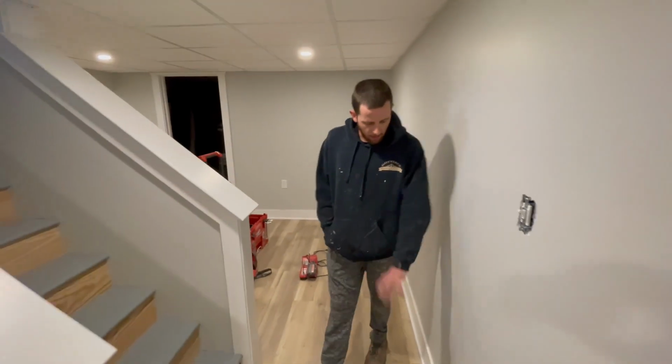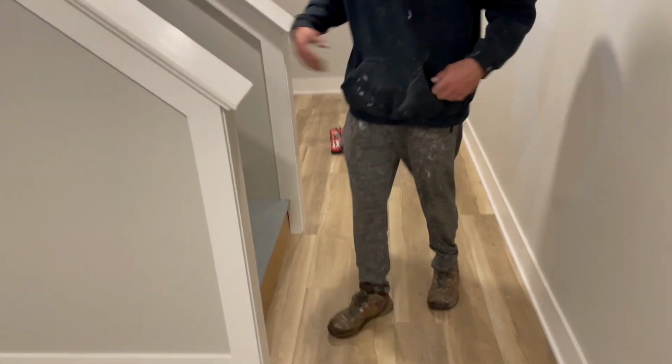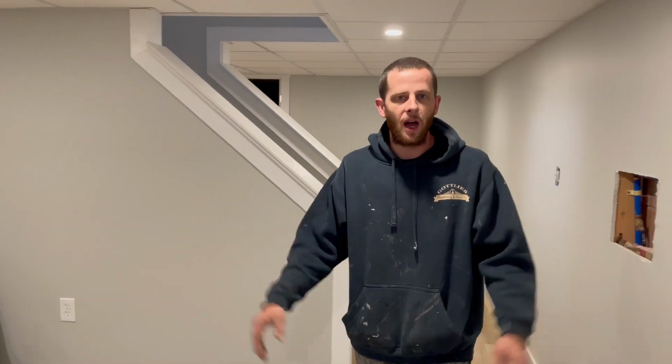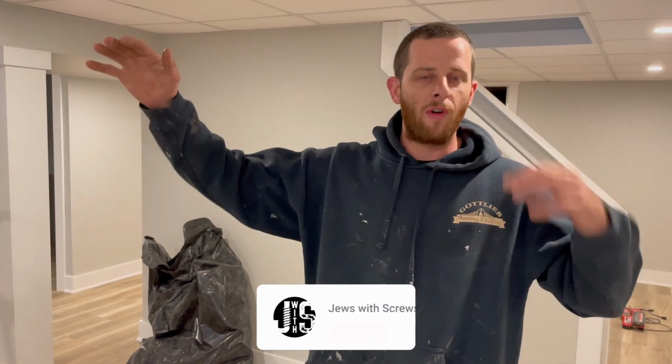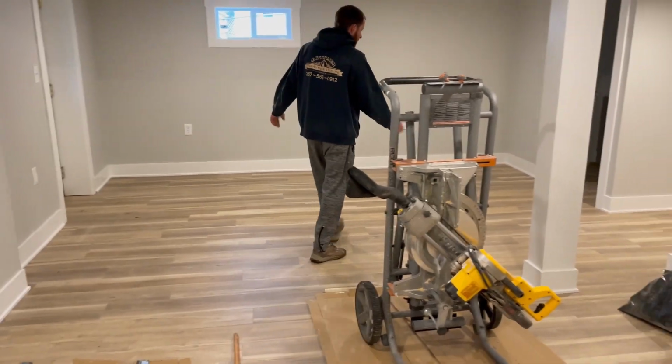So, the basement, same thing, quarter round at the bottom. He's going to hem a piece of carpet for a runner up the steps. I tried going a little fancy with it, but it was probably a waste of time, because these steps are so narrow that by the time he puts a 24-inch runner on, there won't be a whole lot showing on either side. I just didn't like the vinyl to vinyl transition with a full piece of carpet, and vinyl stair nose is expensive and looks cheesy anyway. That was the next best solution, and I should have just carpeted it regularly. Lesson learned.